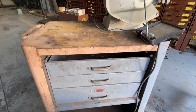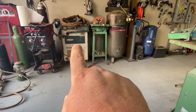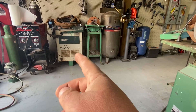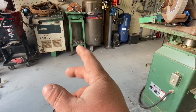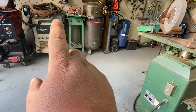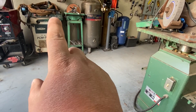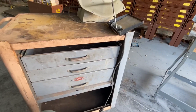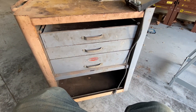I think I'm going to bust out the old oxy-acetylene torch and cut it out. The plasma cutter isn't usable right now - the plug it came with was all cracked. I used it for testing purposes, and the air regulator has a seal coming because it leaks really bad - the part that knocks the pressure down in the back. So we'll just cut it with the cutting torch and clean it up with the grinder. It's a chop tool, but we want to make it look as nice as we can.